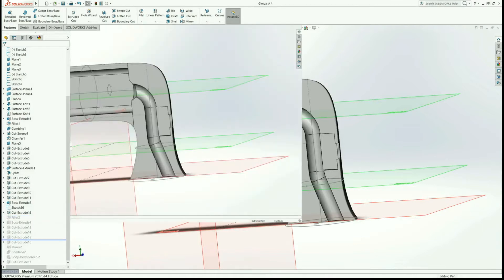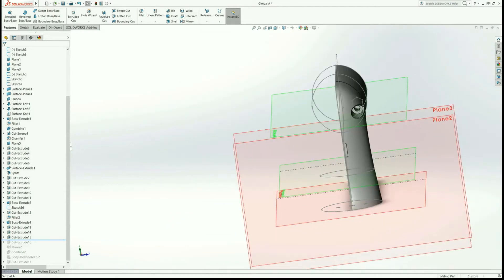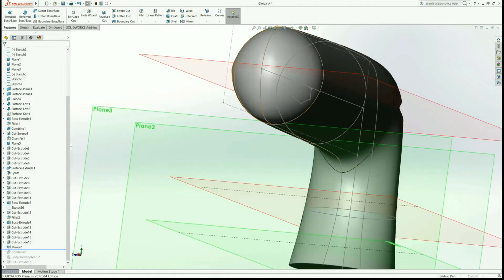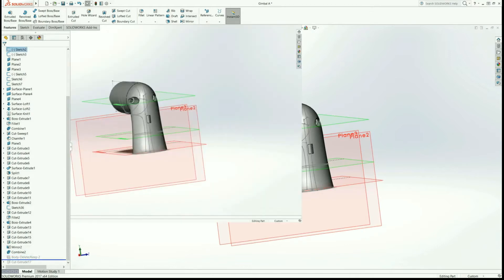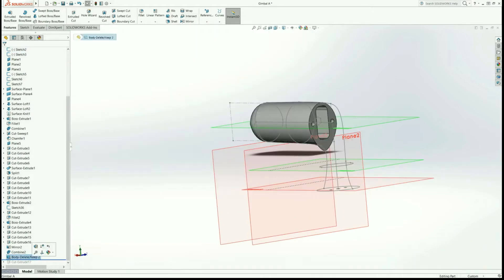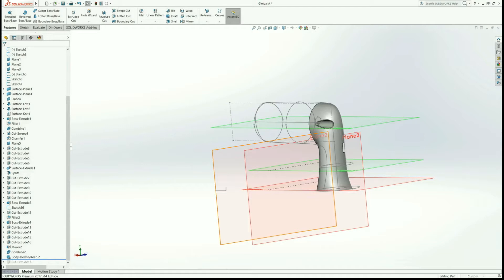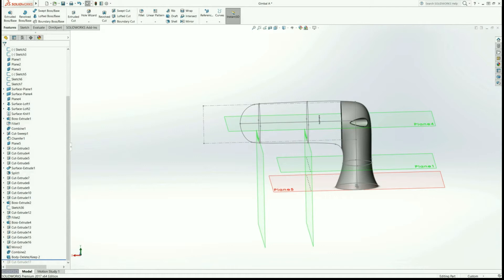As we go down, I finish off and round all the little details — adding a cutout for the switch, a nice little fillet to finish it off — and then I mirror everything over. The only problem is this leaves two separate bodies, so I used a combine to make it one body, keeping it at three bodies total. I then used the body delete feature to delete a certain body, and saved the result as an STL, which is perfect for printing.